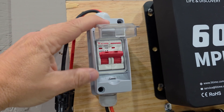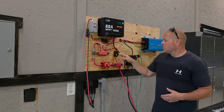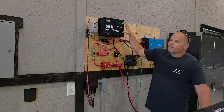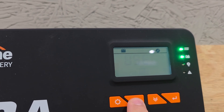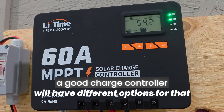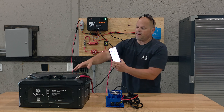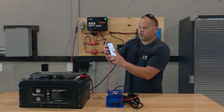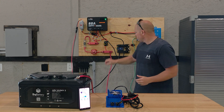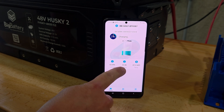I'm going to turn on the charge controller because we've turned on the solar. Right now we don't have anything feeding to the batteries yet because the battery breaker is tripped — you can manually reset it by pressing the button. From here, it feeds in the negative and the positive and activates your charge controller. Depending on your solar charge controller, you have different settings for whether you're charging lithium iron phosphate or lead acid batteries — a good charge controller will have options for that. Now we turn it on to charge the battery. I've made that connection and it flows into the battery and starts to charge up.